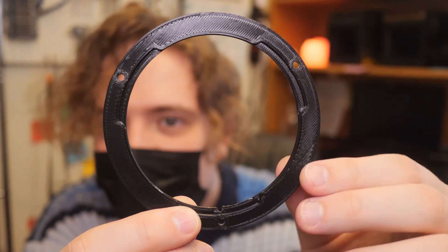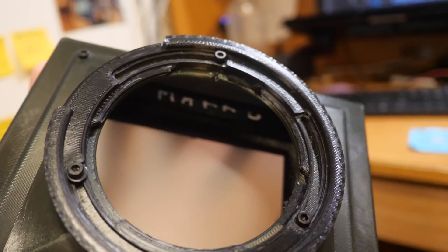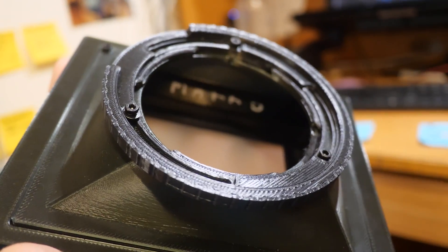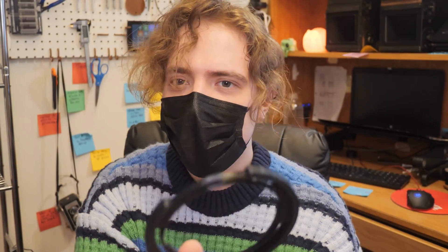So I came up with a kind of weird solution. It's a little ring with grooves to mount the Mamiya Press lens, with the idea being that you can switch out this ring for different mounts — like a screw mount or whatever. It also has an outer retaining ring that rotates to lock the lens in. There are a couple of 3D printed camera projects that use Mamiya Press lenses — the ones I looked at, like the Bronco Pan and a couple others, use a similar screwed-in system.